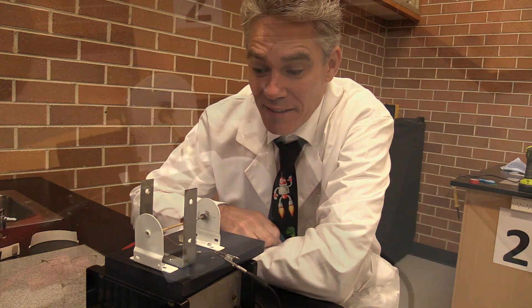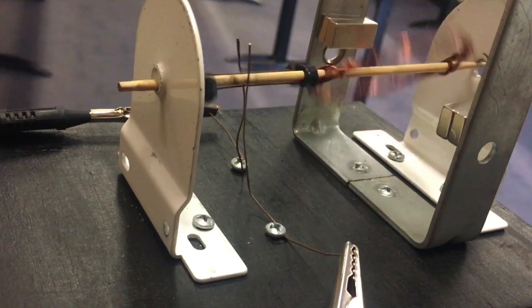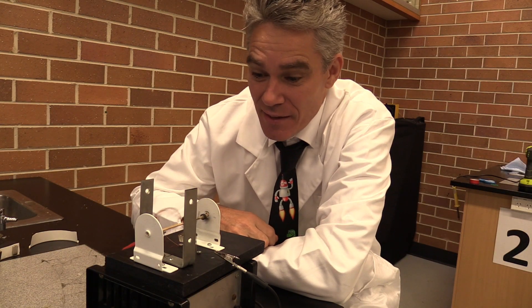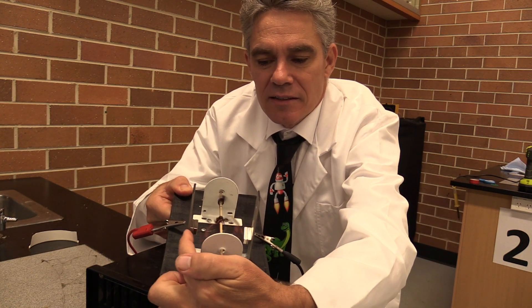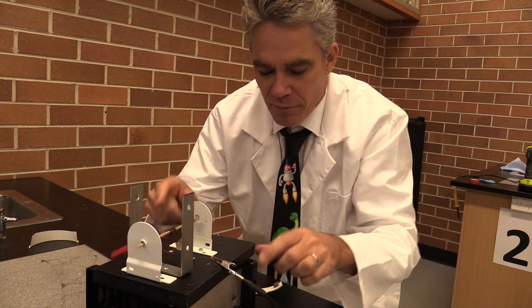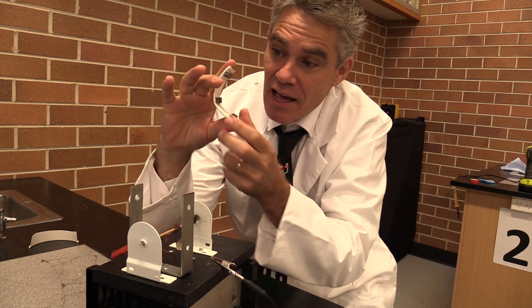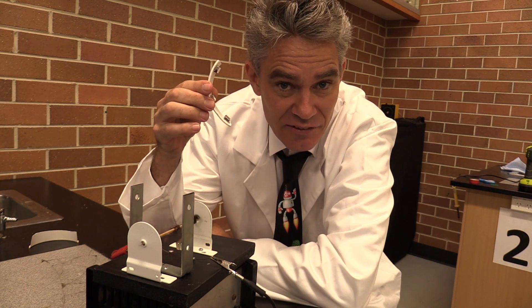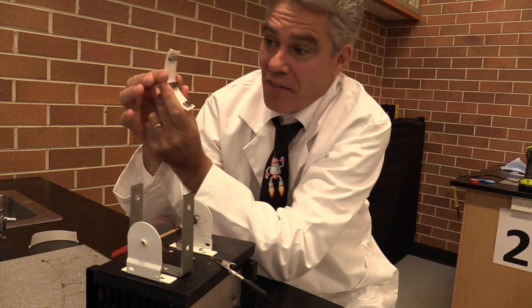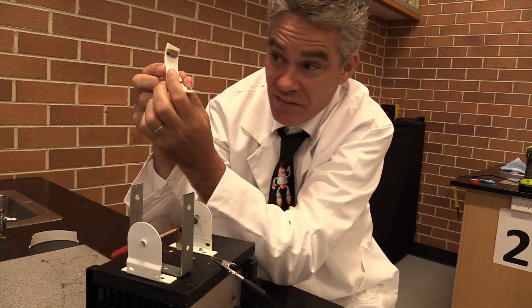Check out this beautiful little DC motor that a year 12 student of mine made. It runs really quite nicely, but I made a suggestion to them — instead of having two magnets stuck there like that, it might have been better to put the magnets in a radial magnetic field, so that as the coil went by it was nice and close to the magnetic field each time, and the direction of the magnetic field would always be perpendicular to the axis of rotation, giving maximum torque.